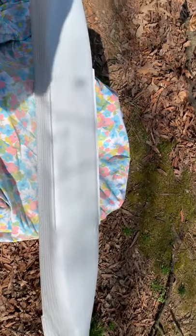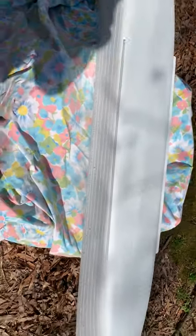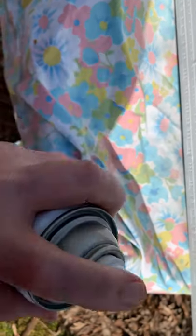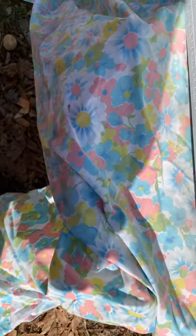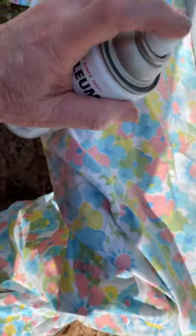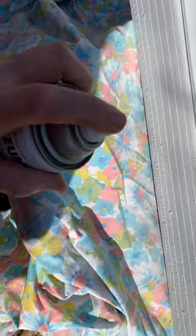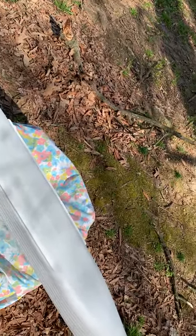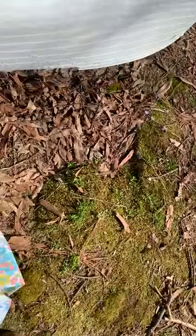The trick, and it's really quite simple, is to lean to the side just a little bit. Get your spray can and your arm out, and don't pivot at the wrist — instead, move your elbow and your hand together in a straight line. That way you maintain the same distance from your subject all the way through. Even if you have to do a long subject in two passes, it becomes a lot easier once you practice this technique.